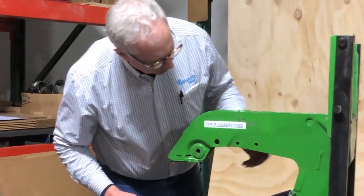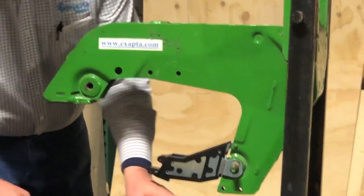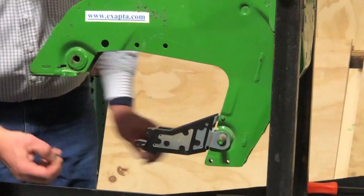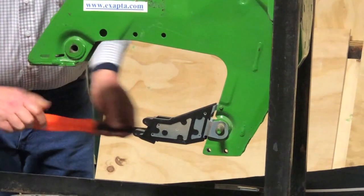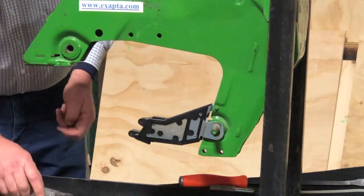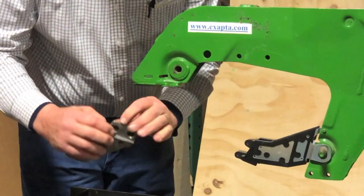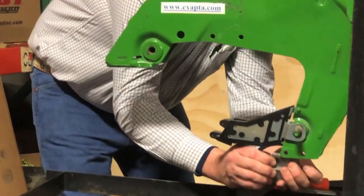As you can see, we have our 7200 row units stripped down and ready to go. Some of these may be tight in this area if the bushing does not slide in easily — you may want to take a pry tool and adjust it so it slides in. For the install, we've already assembled the wings onto the Valiant guard. We'll put the bushings in and then slide it into position.